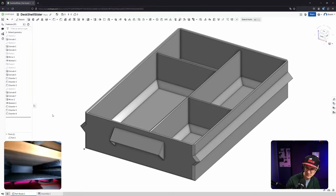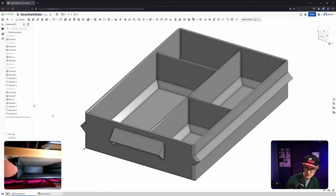And it's just this way I can print it upside down on the print bed. It prints perfectly because of those 45 degrees, which are printable. And I think I'm lying, because this would then be a bridge. And I think the quality of this is way too good. So I think I printed it standing on the back side and then printing upwards. And actually, I can see the layer line, so I'm stupid, you know.